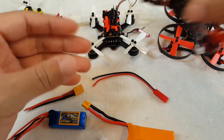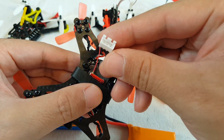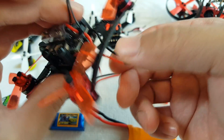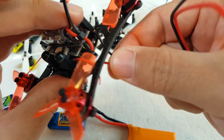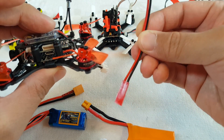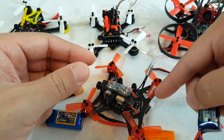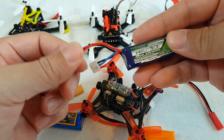Taking all those things into consideration, I was going to upgrade the connector on my King Kong 90 GT. It comes with an unusual 2S balance lead connector using really thin 26 gauge wire, which is really thin. You might think you could just cut off this connector and solder on a JST, but it would be better to desolder the whole connector all the way to the PDB and put on a new JST with a thicker gauge wire. Swapping just the connector wouldn't make sense, especially since I want to match the battery I'll be using. If I have a 20 gauge wire here and a 26 gauge wire on the quad, that thinner wire is the limiting factor on how much power I can push through.